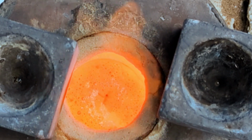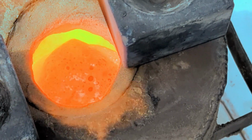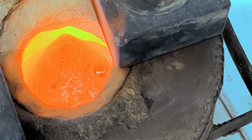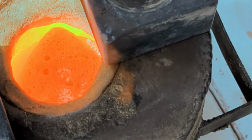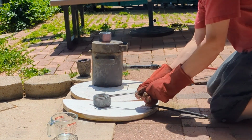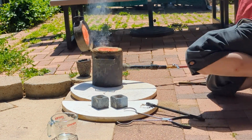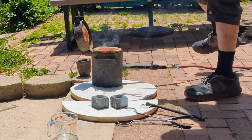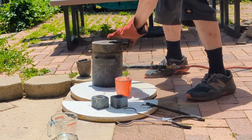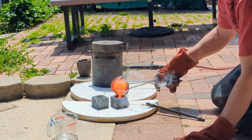Cutting it pretty close on this one. Maybe not so much in the next smelt. I have had a little bit of a boil over. Definitely not to use so much of the concentrates and flux in the next smelt. It should be fine. All the heavy should still be at the bottom. Good, not too big of a mess. Should be good for the next smelt after the pour. Nice and liquidy, yeah.